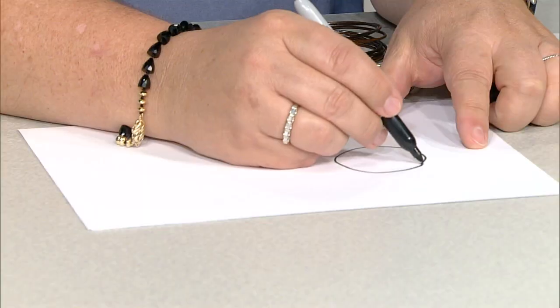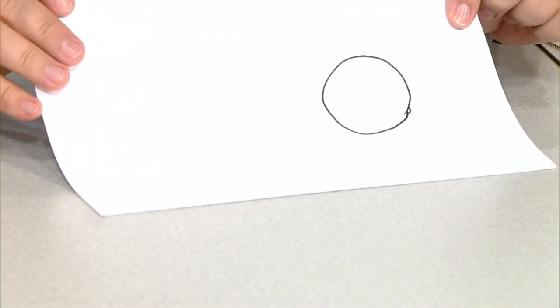So why don't we start with the German round? Or do you want to just draw the shapes of what they're like? Yeah, I think we can start by drawing the shapes and talking about it. Okay. So German style wire is a harder tensile wire than the artistic wire. So if you want a round wire that works in these, you can choose either the German style, which is going to have a harder temper, harder to bend, easier to make into bracelets that will last a lot longer. If you bang them, they're not going to bend quite as easily as the artistic wire. Artistic wire, of course, is a soft temper, and that makes it a little bit easier to work with. So the 2, German style harder wire and artistic wire softer wire, will both work about equally the same, only one's going to be a little tougher.